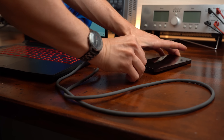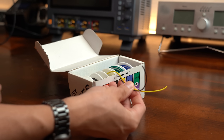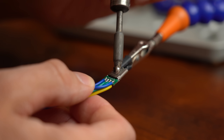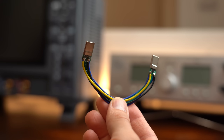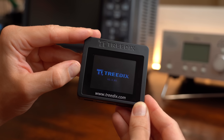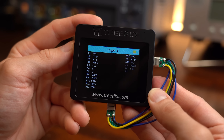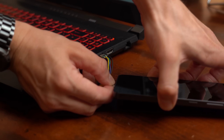Let's look at my DIY USB-C cable and why even slow data transfer doesn't seem to work anymore. I firstly created a shorter USB-C cable with the same wiring as my long one, connecting power, the CC pins for configuration, and D+ and D- for data transfer. I then got myself a USB-C cable tester — not super cheap but super useful for checking what USB-C standards are fulfilled and what pins of the connector are hooked up.